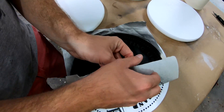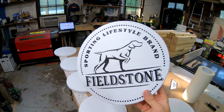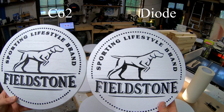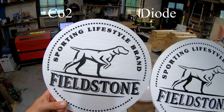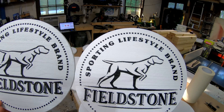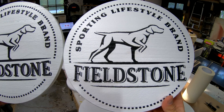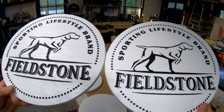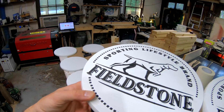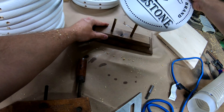With a price tag of $2,600, we would need to sell 58 of these $45 signs, and with the speed of the CO2 laser that would take about 16 hours to complete the engravings. I also want to point out a major difference between diode and CO2 lasers: diodes are really good for engraving but not so good at cutting. CO2 lasers are much better at cutting — with this 60-watt laser, cutting eighth-inch and quarter-inch materials is pretty easy. Diode lasers are mainly utilized for their engraving capabilities.